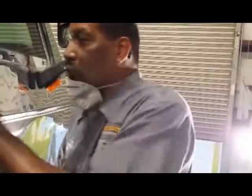Again, if you're not comfortable with the high-speed grinder, you put that on a slower grinder or a slower buffer. You'll be just fine. You heard me toggling my toggle switch. That helps you clean up some of the black. When the wheel slows down, it wants to grab that rouge and that compound left behind, okay?